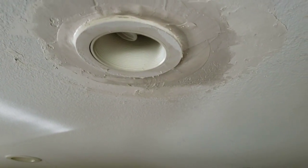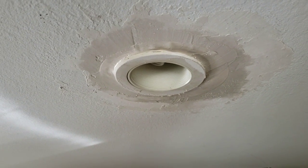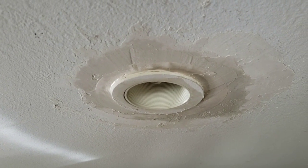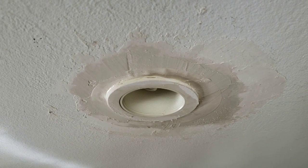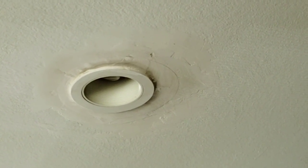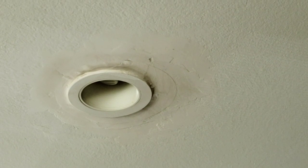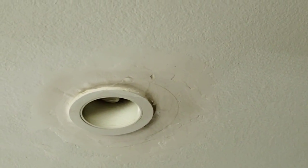There is the first coat on, and you don't have to freak out. It's not a finish coat. It's just to set this real well and to get it stabilized. And then we'll be finishing up with a top coat. And we'll take the sponge to give it a little bit of a dappling effect there. Not finished yet, but that's drying along pretty good. I've sanded it slightly. Let it dry a little more, and then we'll put our second coat of mud on.